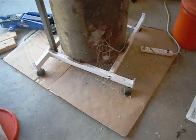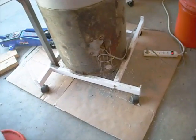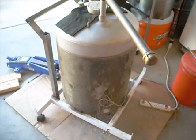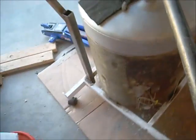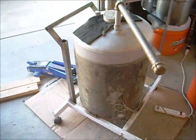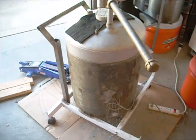I still have to work on the burner. I have a small burner — not my 2-inch, I'm not going to fill my 2-inch hole — but I do have a 1-inch burner that I'm probably going to start out with. I don't know if it'll get this whole thing that hot. It's a pretty big area to heat up — 12 inches round inside there and 13 inches deep. I don't think it will be enough to heat that whole area up to the temperatures I need to melt aluminum, but we're going to keep going.